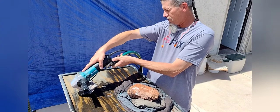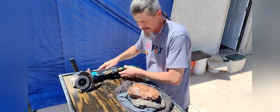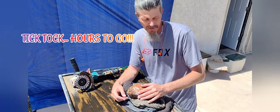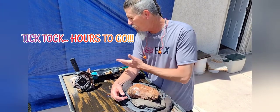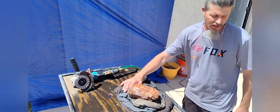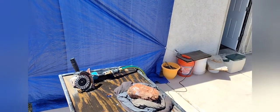We're going to start off on 1500 RPMs with the steel diamond disc. When we get more into the polishing pads, around 800 grit and up, we bump it up to about 2000 to 2200 RPMs. So let's get started on lapidary project number 17.